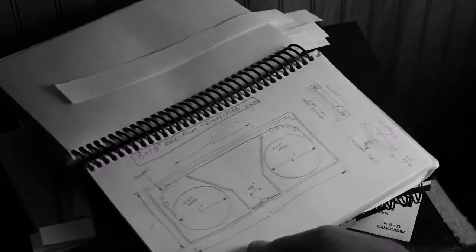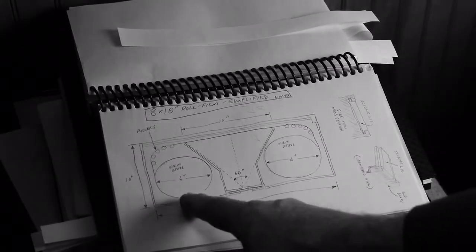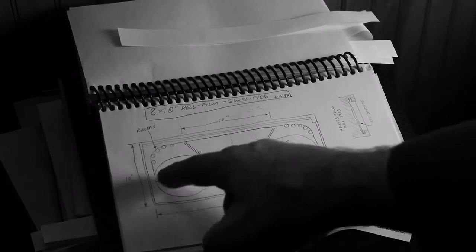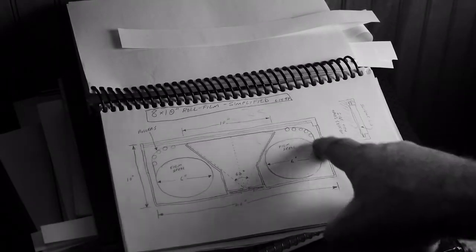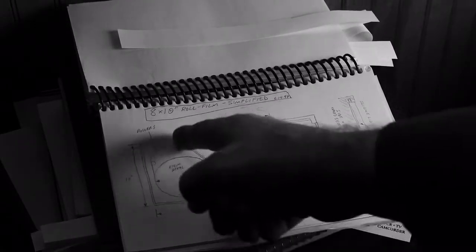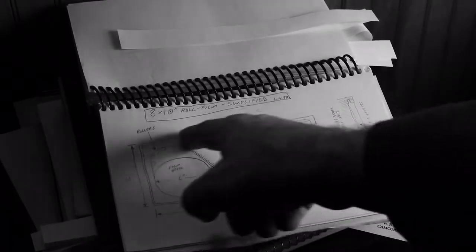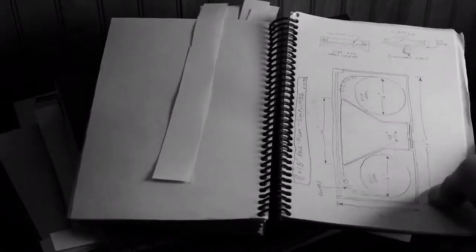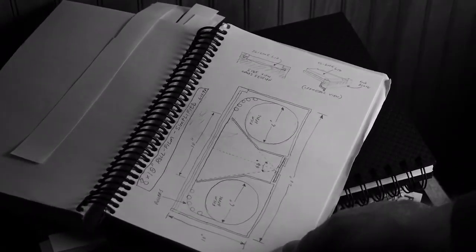This one is dated 1997, and apparently he's thinking about using 8 by 10 inch sheets of paper. So this is like a giant roll film camera on large 6-inch diameter spools, and the film wraps off the spool, runs around these rollers to the film plane, back to the other spool, and then he has this light baffle system that keeps the light from the pinhole from fogging the paper on the spools. And here is the image area right here. It looks like a 10-inch wide image area. So a really large roll film camera. So this is one of the documents I was able to come up with that documented this paper roll film camera.